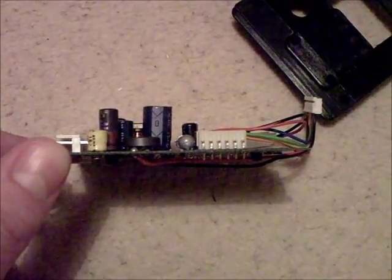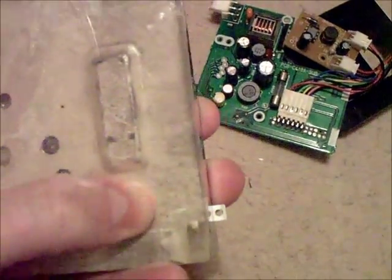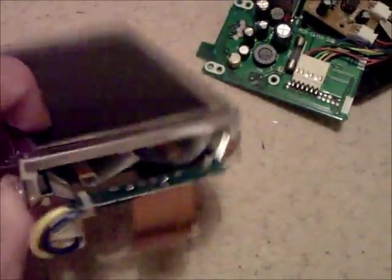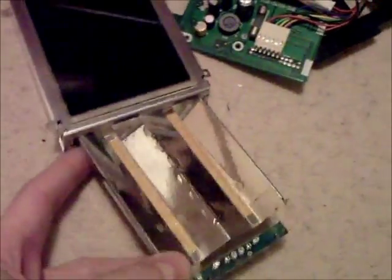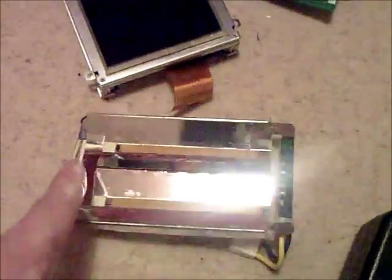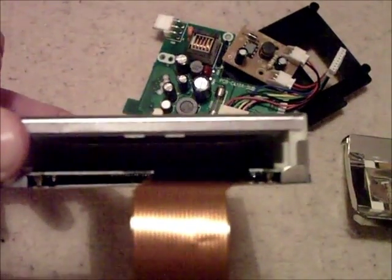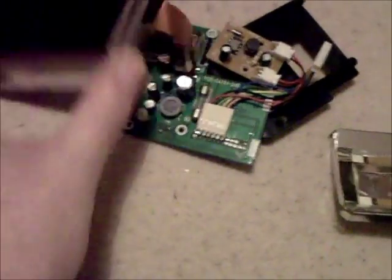The new LCD's inverter board is just a circuit board built onto the back of the actual screen — you don't even see it. So that came out; we don't need that at all anymore. This is the LCD itself — an enormous chunky thing with rust on it. These marks here were just plastic film on the back; it looks like liquid's leaked but it's just sticky. This is where the tube was — a big U-shape or C-shape tube sat in there which was smashed. Quite low tech really for 1997 when this was made. Current's passed through the mercury vapour to illuminate the LCD. A huge pile of junk has come out of this thing and it's much, much lighter.